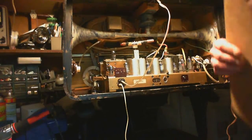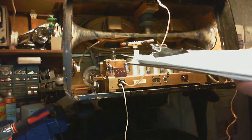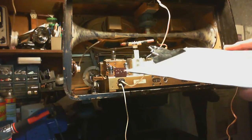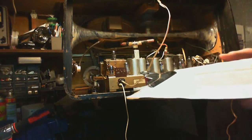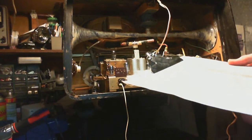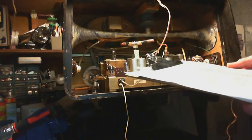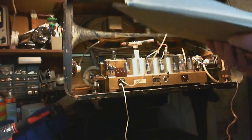That'd be a little strange though, don't you think? Making a radio where the FM tubes don't heat until you switch to FM, because then you'd experience a wait time. Now that doesn't make sense. For what? And why not heat them? Two tubes out of all of this? It's another 10, 12 watts or something at the most. What would it matter? It's more like 6 watts. I can't imagine that. I've never heard of that being done, actually.